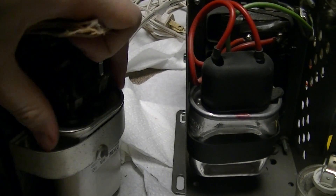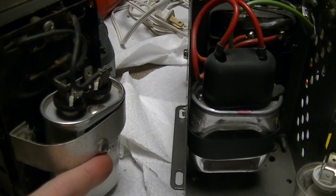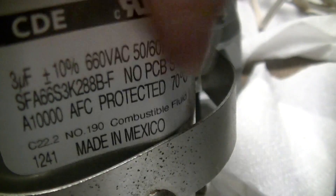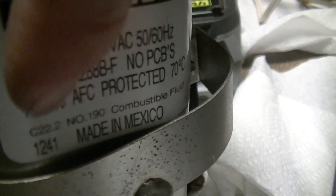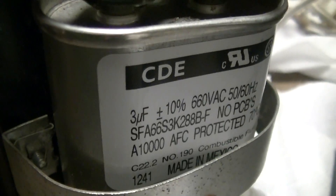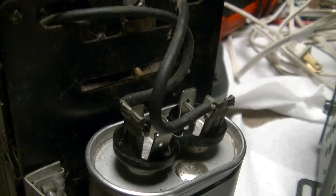These don't really operate hot enough for cardboard to be a problem. If they do get that hot, bad things are going to happen anyway because of combustible fluid. The spec is 158 degrees Fahrenheit, and these are rated for 10,000 amperes fault current because they're often used for fault-current-rated applications.